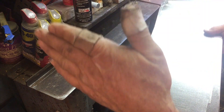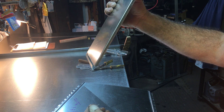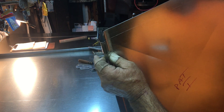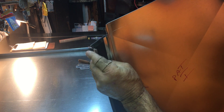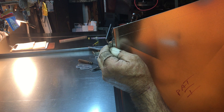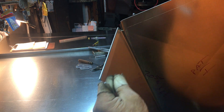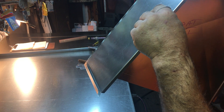I'll show you how to bend one end in and the other end out so that you stay in line with the larger duct on the inlet and re-align with the smaller duct on the outlet. As we assemble this transition, you can see this end here needs to be cocked in a little bit — it's going to come down and cock in to line up with the larger duct. Then as you assemble it up to the top, it has to cock out to straighten it up with the smaller piece of duct going the other direction. Obviously this is not assembled right now, so this looks nothing like what it's going to look when actually assembled — it's going to be up close, really tight, with minimal air leakage.